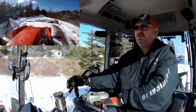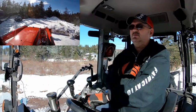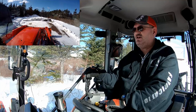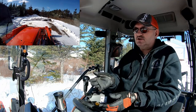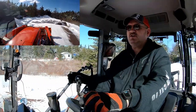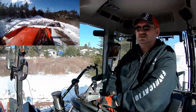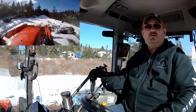Let's go have a look — I have some snow left over from the other day. Now I'm going to put it in float mode. I've got my wheels cut, and she's still going straight — just turning a little bit, but not much. Now if I don't use float mode, I put my bucket down, take a little bit of weight back — pull my blade not off the ground, but just up enough to put the weight back on the front wheels — and now I'll make the turn. See how sharp I can turn? So we'll do it again: float mode, wheels are cut right to the left, and she's just barely starting to turn. You can see the difference with float mode and without.